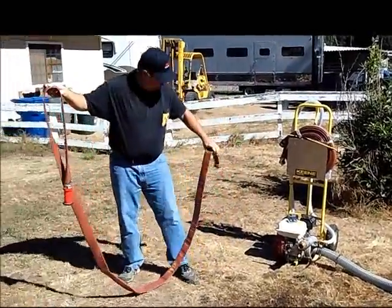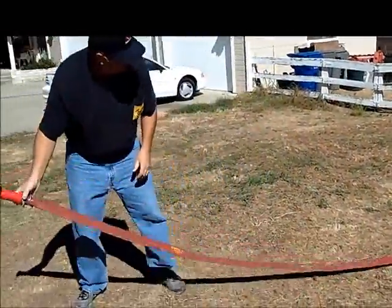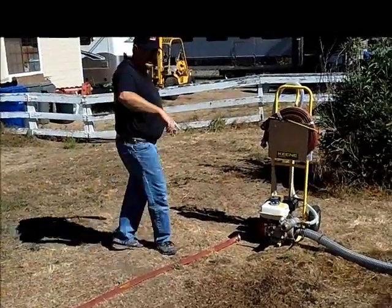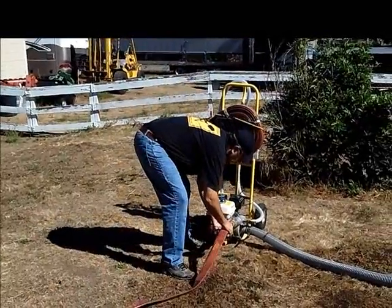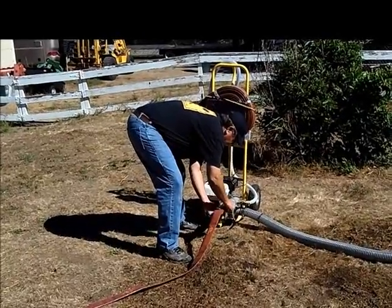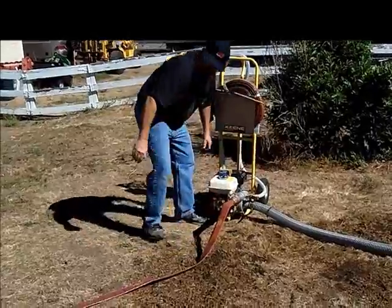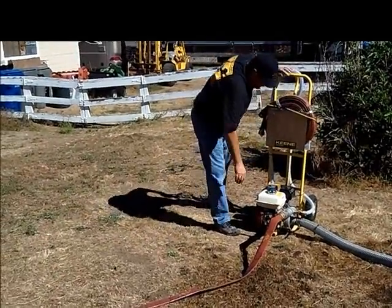You want to take your hose — because I'm using the short hose — and lay it out where there are no kinks in it. If you're using the long hose, you can lay it out in a big S-pattern. The inch-and-a-half national hose goes onto your valve.